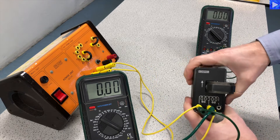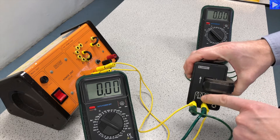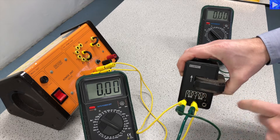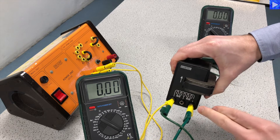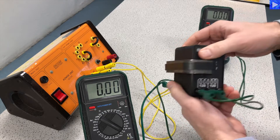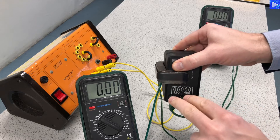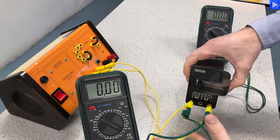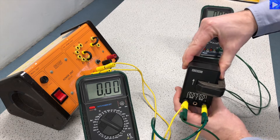These coils are adjustable. On this set of coils here, there are two coils within there. I can either put the potential difference across just one coil of 60 turns, or across both coils by inserting the inputs here, making 120 turns. On the other side, I have two 120-turn coils, so I can either use 120 or 240. The two sets of coils are connected by this iron core — that's my transformer unit.